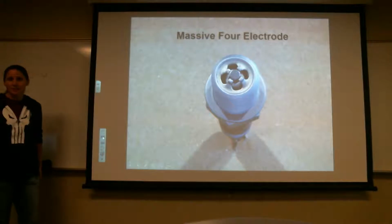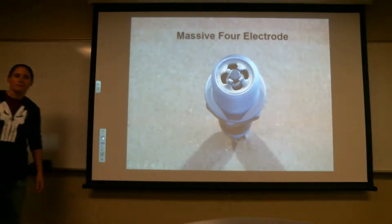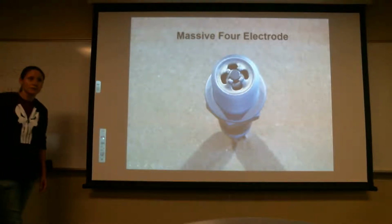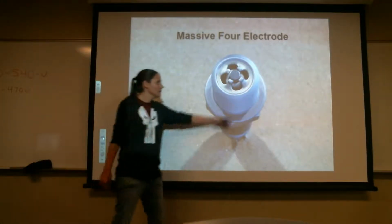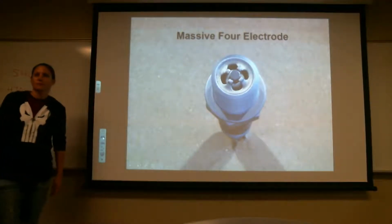Oh, okay. How common is it for the electrodes to fully contact where they ground themselves? Run that by me again? How would that happen? A foreign object, or more like carbon. It's a huge factor. You get carbon in there all the time, you get all sorts of stuff in there. If it's grounded then the whole thing's screwed, right? Yeah, if you have a piece of carbon in here that's touching both sides, it's not gonna work. Ground it out. Misfire.